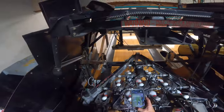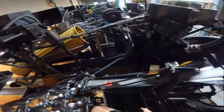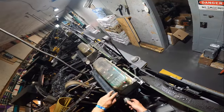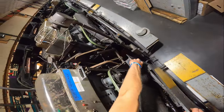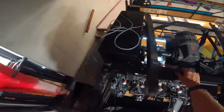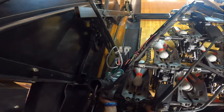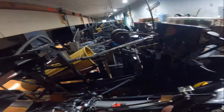Now if we plug our machine in and turn our B switch on, the machine should power on. If you lift up on this side of the table it should black it out because it will activate that micro switch — and it does. So we know that switch is good to go. Obviously our power to the machine is off now so we can stay in here.